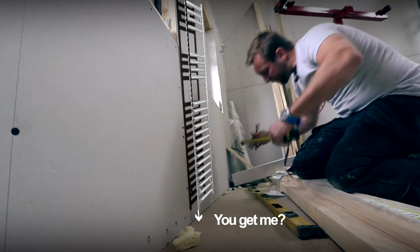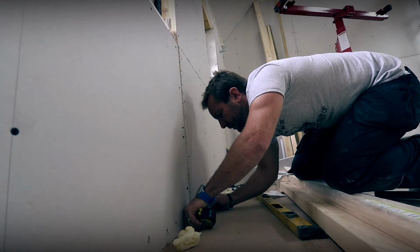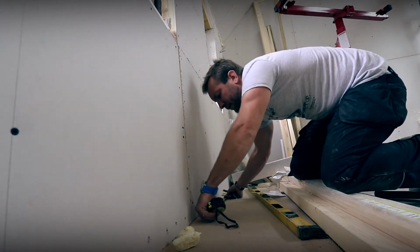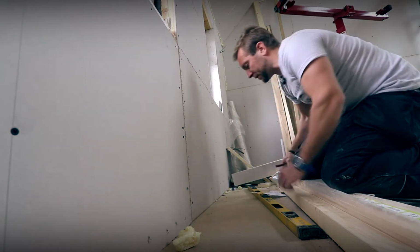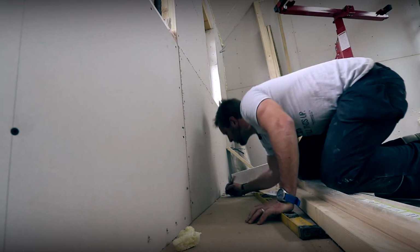And then 455 divided by 2, 227.5. And that's the actual pipe width. So if I do that now, that should read 455. Okay, cool, so there, now we know that I've got my mark on the floor here. X marks the old spot.